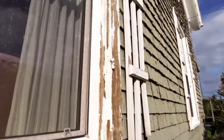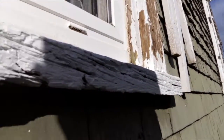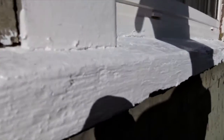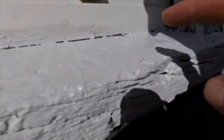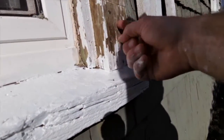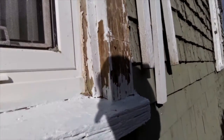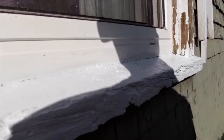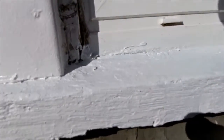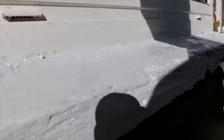This is what you get in a hundred-year-old house. This one's pretty rough and gnarly. I slathered on primer as much as I can - I may have to do two coats. I'll have to do some caulking as well. This is starting to dry rot - you know it's dry rotten when you can stick your fingernail into it and it just crushes. It's not bad though, not dry rot all the way through. I opted to leave this one since there's no cavity that collects water, so it will fare better. I'll do probably two coats of primer to really seal this so the water just slides right off.